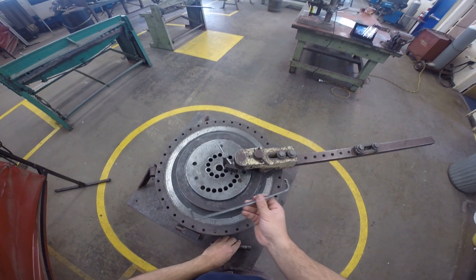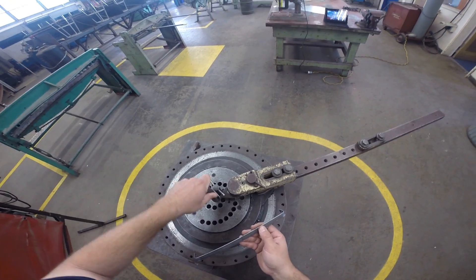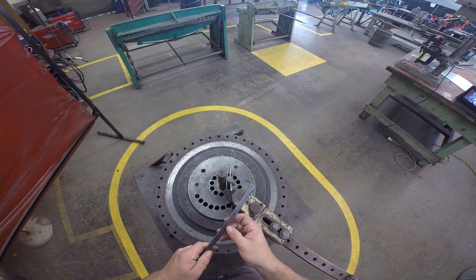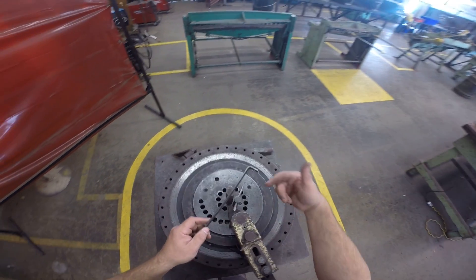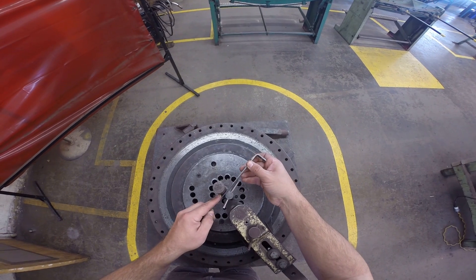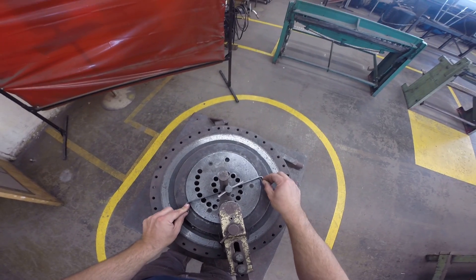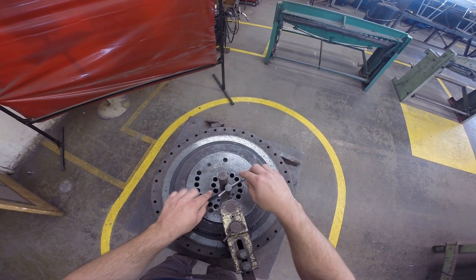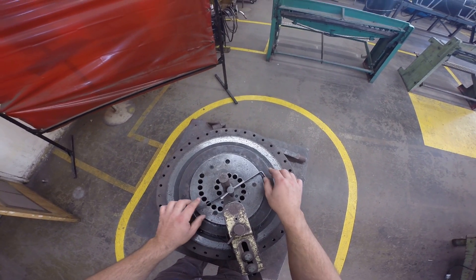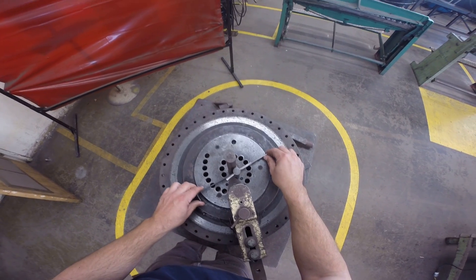The next one — to bend the handle — I have my pre-mark here. We're going to now use the rounded center pin. We'll place that in like so. Don't make any adjustments to the rest of the diacro settings. This time, you're going to have the feet pointed out here towards the handle. There's my center line, so I'm going to place them right in between the slots. One way to double check: you can see that your feet are equally hanging over on both sides. Make sure that the handle is placed flush down on the diacro — if you have it sideways, you're going to get a dog-legged handle. So I have equal overhang on either side; that's one way to check that you're centered.